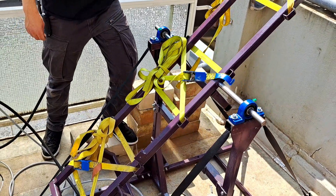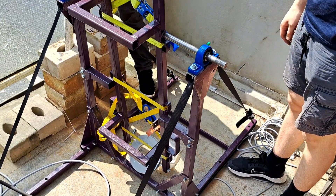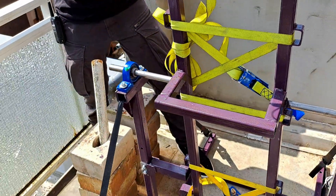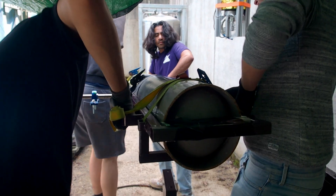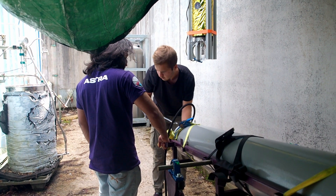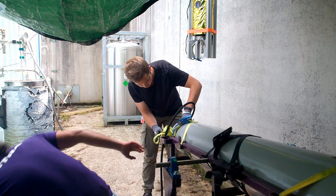If you've ever tried to stand up a bottle on its head, you'll notice this is actually quite difficult and potentially dangerous — not a great plan. So you're gonna need some sort of apparatus to allow the nitrous oxide bottle to be flipped. To this end, we have designed this fancy-looking contraption which will be able to flip the nitrous oxide bottle, making sure that our valve is pointing downwards so we can get liquid moving into our tank. It's a fairly simple contraption consisting of a base, two columns, and a rotor which sits on those columns and can be rotated. The bottle sits in that rotor and when you flip it around you're effectively flipping the bottle. Lock it in place and you have a perfectly functioning flipping station.